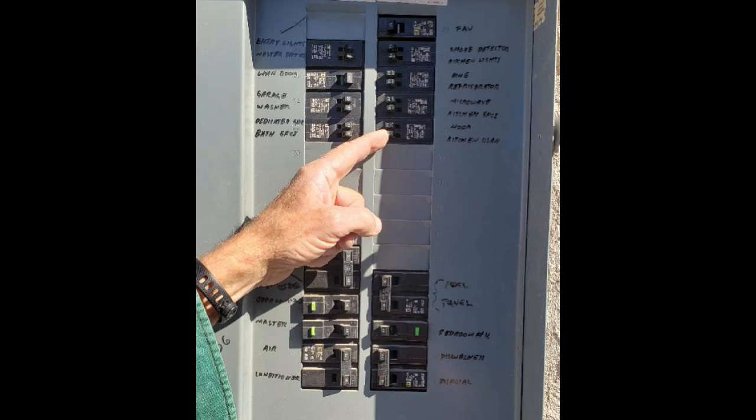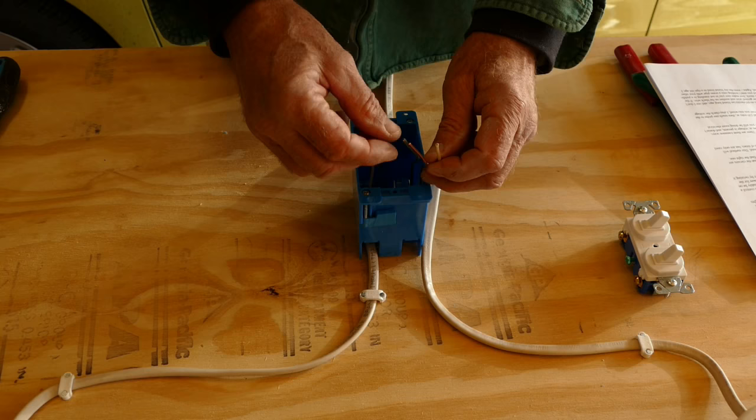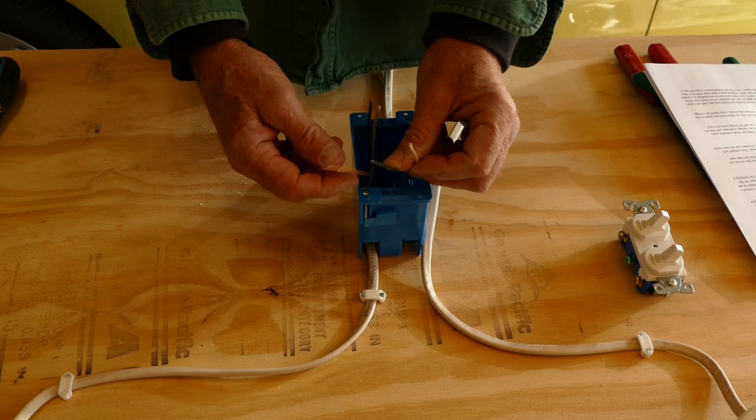I've seen some electricians pop the circuit breaker by shorting the black wire to ground, but this isn't a good idea. While breakers can be turned on and off thousands of times using the switch, they will quite likely stop working after only a few short circuits.